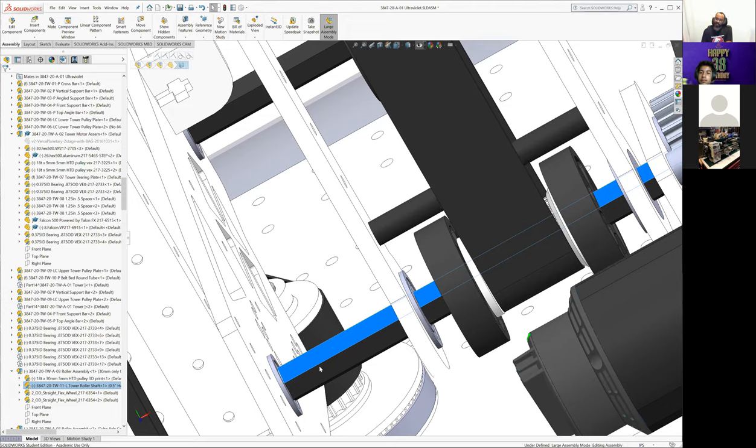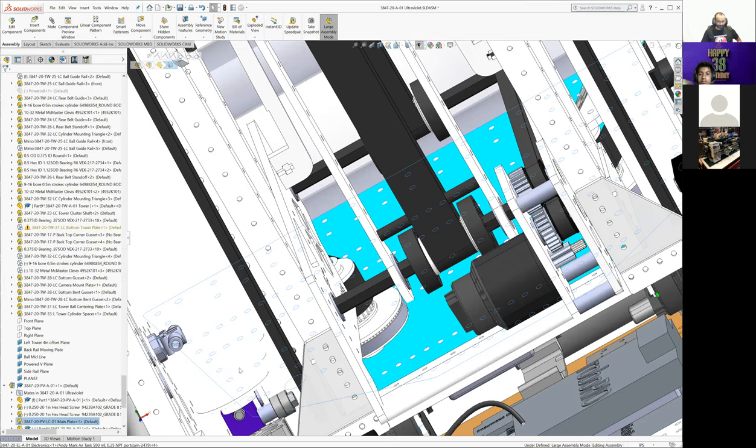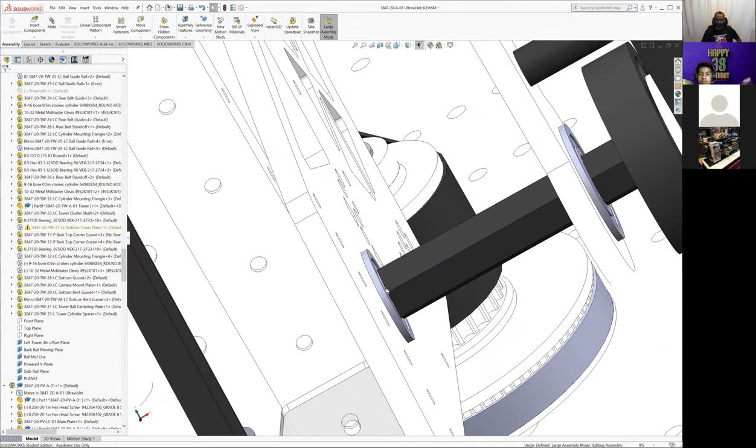Did we do the counterbore this season? All these shafts were counterbored and tapped, right? Yes. Stemming all the way back to a misordered shoulder bolt from the 2017 season, we found it actually helps, so we kept doing it. Basically the shoulder's actually longer than the bearing. To just do the bearing, you need like a 5/16 shoulder bolt, I think, and I misordered in 2017 and ordered 5/8 shoulder bolts. We've kept the 5/8 shoulder bolt that goes further past the bearing.